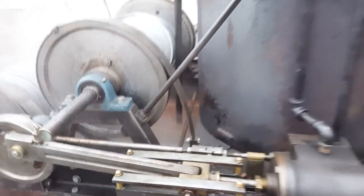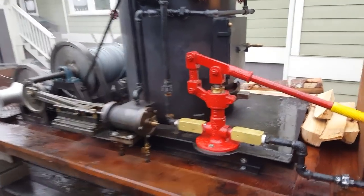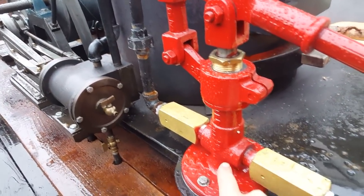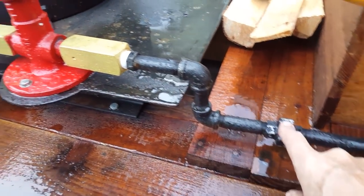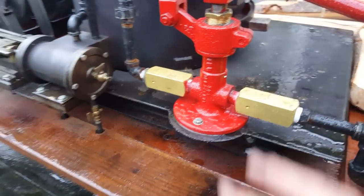It's a good way to blow it down and drain it when you're done using it. Also, to drain it completely, take off this union here so all the water comes out of the pump so it doesn't freeze. Same with inside these pipes — make sure no water is left so it doesn't freeze.